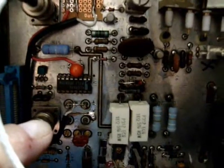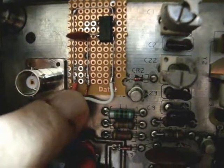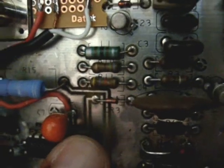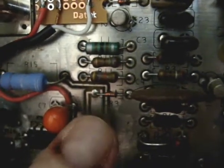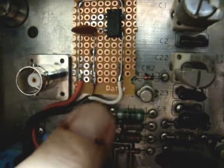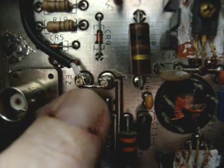It can already be fitted in the circuit because it's logic level five volts, so it fits in there real nice. Here's the oscillator chip on the board. The red wire is plus five volts, and that goes down to C7 right there — we can pick off five volts right off the plus side of that capacitor. The RF out and ground go down to E2 on jumper E2.